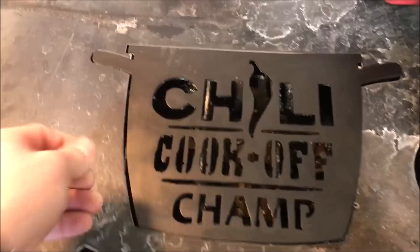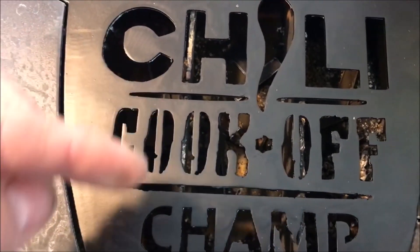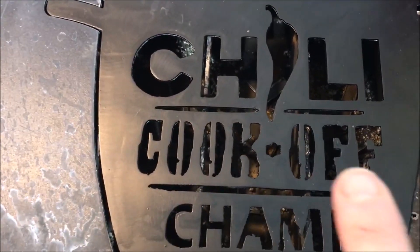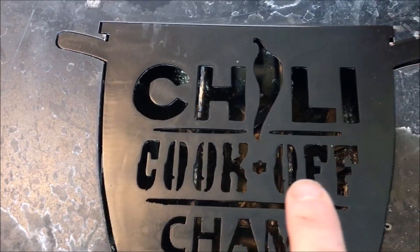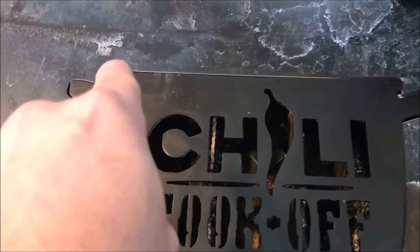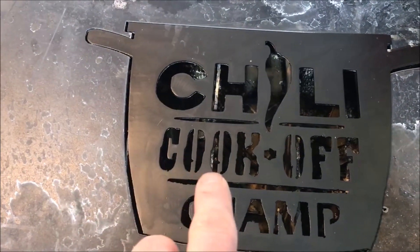So let's go back over to the machine here. As the machine runs this way, I think it's cutting correct. But as it runs this way, I don't think it's working. Maybe just in one direction, or maybe it's backlash. I'm not sure because the outside of the pot looks very good. So once it starts to travel in one direction it does okay - it's that quick back and forth that's not working when it goes this way.